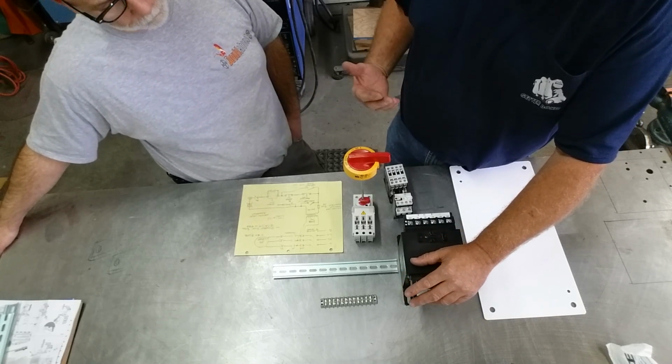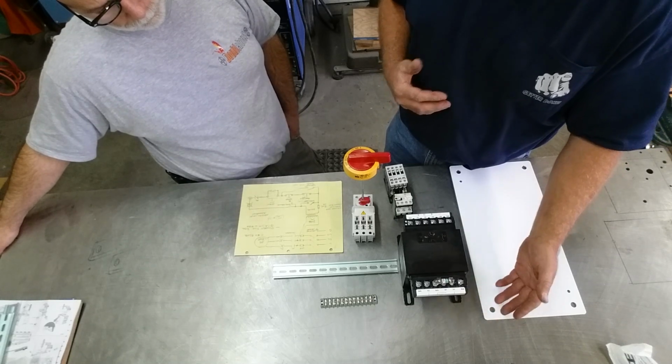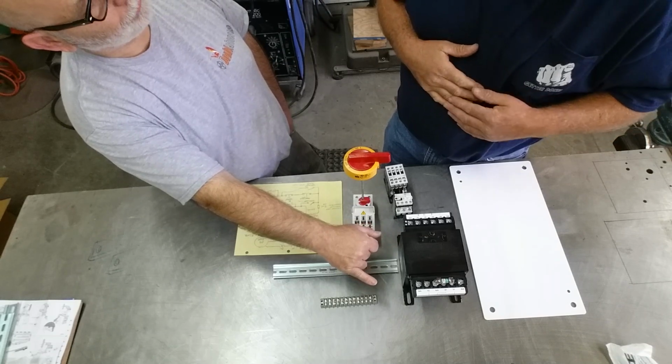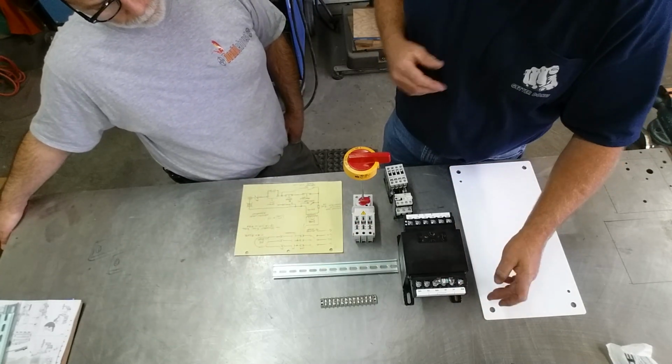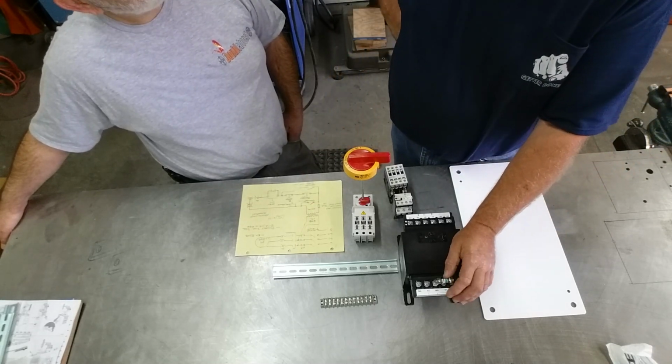That's right. So we're phasing it out and we're grounding our neutral side. That way we don't end up with a hot neutral running around. Well, we actually have grounds on either side of this, right? Well, the case is grounded, obviously. But we do need to ground out the actual neutral side. Otherwise, you end up with a hot neutral.